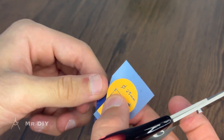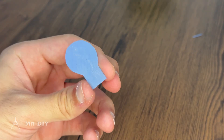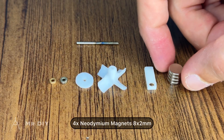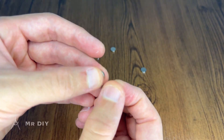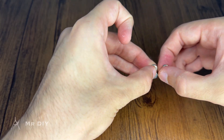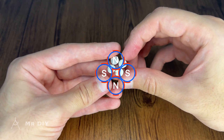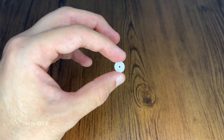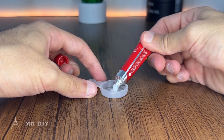One of the primary objectives of this project is to achieve smooth and silent operation. To meet this requirement, I designed a custom internal pump incorporating a magnetic drive system. The system utilizes high-strength neodymium magnets, each measuring 8mm in diameter and 2mm in thickness on the propeller side. The magnets are arranged in an alternating polarity configuration, such that each magnet is oriented opposite to the polarity of the adjacent magnet on either side. The magnets are secured to the shaft using a 3D printed magnetic disc, with each magnet bonded using a high-strength two-part epoxy adhesive.